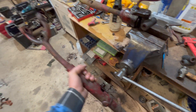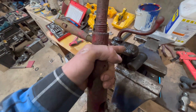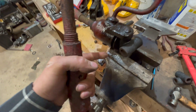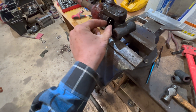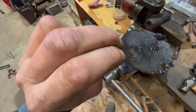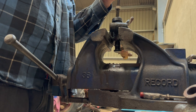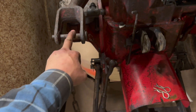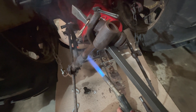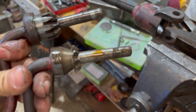I managed to get the one out of the drop-down arm that pivots a little bit out a lot easier. It was trapped in the knuckle, whereas these were trapped at this side. Also while doing that, this has come loose, which I'm quite pleased about because I haven't had to rive one of these out — that's missing on the Roadless, so I'll be able to copy that. I got these knuckles for the two-wheel-drive B450 and they're seized to the drop-down arms same as the Roadless, so I had a freeing-off session.